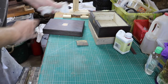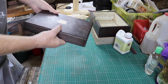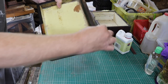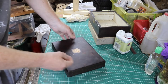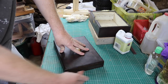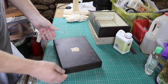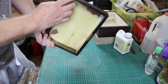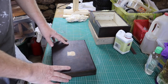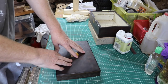Right. So that's everything rubbed down. Now it's for the polishing. I'm going to start with the top, but we've also got to polish these as well. And it's not easy. You've got the lid down like this. We can't polish down to the bottom where it's resting on the table, because you're going to pick up dirt and dust, and we need to be doing the underneath at the same time, just around these edges, and we can't do that if it's lying flat. And we've got no way of holding it either if it starts moving around or rubbing. We can't put our hands on it.